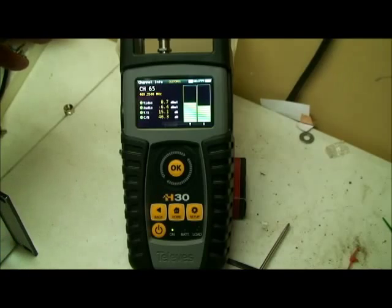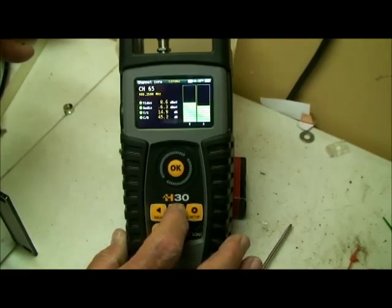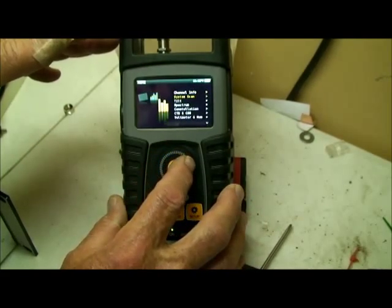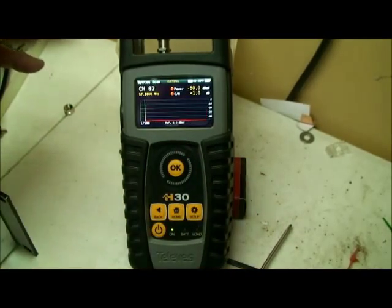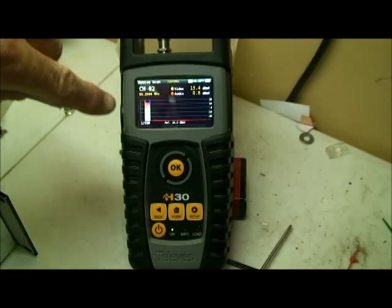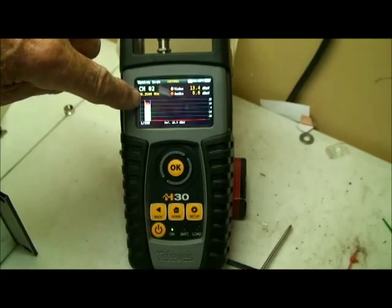So what I'm going to do now is show you how to get to the digital spectrum. We're going to press the home button. I'm going to rotate this little indicator around here, and all you do is press your finger on it and rotate it around. Press the OK button, and now it's going to scan my entire spectrum. And my entire spectrum indicates that, on my channel 2, that's where that little gray line is.